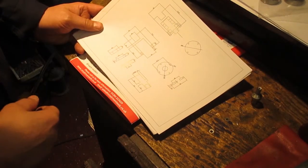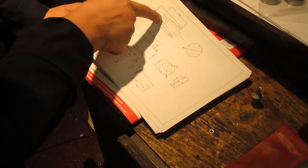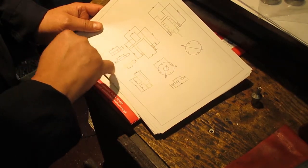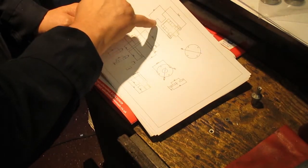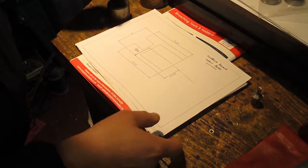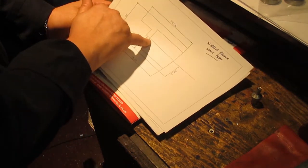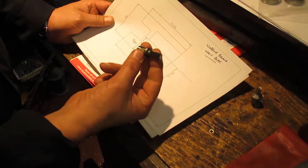As you can see, this is my drawing for the wobble broach or the hex broaching tool. This is the main body, this is a bearing, a thrust washer plate, a thrust washer, and then the actual holder itself. This is all drawn square. Now I've canted this over by one degree - I've got a slightly larger picture here. What I've decided to do is actually put the one degree inside the actual holder itself, inside the body. The centre line runs through the workpiece and this red line is essentially replacing the tool bit.